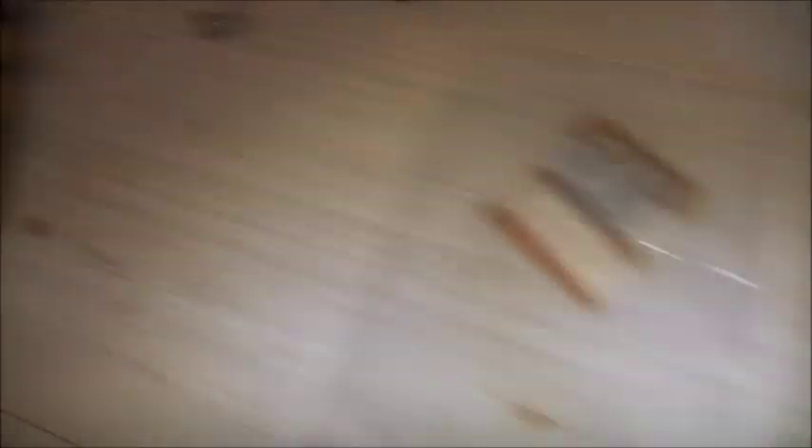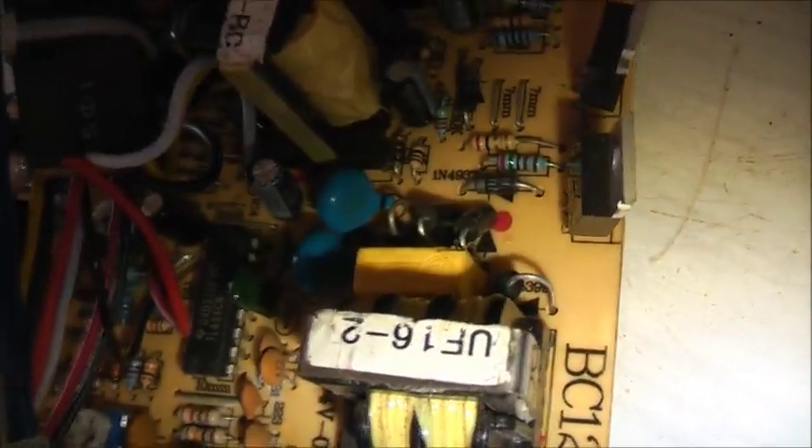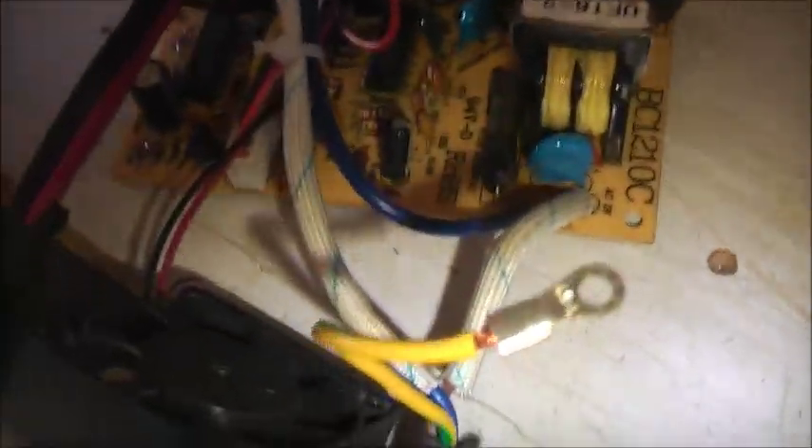G'day viewers, my little transistors arrived here for this switch mode charger. I've found that a diode seemed to test zero volts both anode and cathode. That one here tested okay, so I've got a replacement one. Just replace that one here. I'll replace these first and get that fuse out because that's obviously blown.